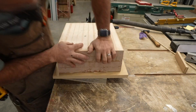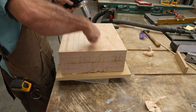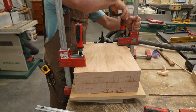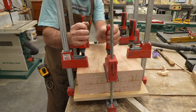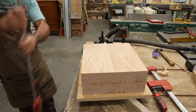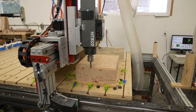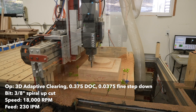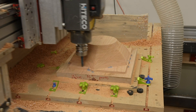I forgot to take the old tape off, but I noticed my heat gun made it really easy to peel off. Like before, it's a quick clamp-on and clamp-off to squish down and adhere the double-sided tape really well. I put it back on the machine at the exact same location and started the roughing pass. I like to use Fusion 360's adaptive clearing strategy — it rapidly removes a lot of stock and gets everything really close for a good finishing pass.